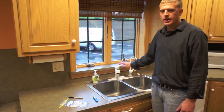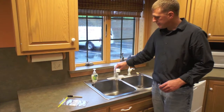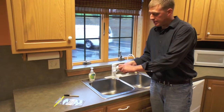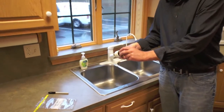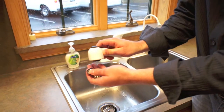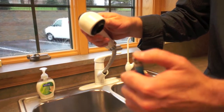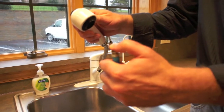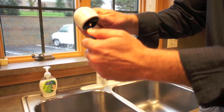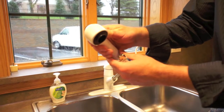You can shut off the water and the next step is to take your match or lighter. At the tip of the faucet, most faucets will have what they call an aerator and that should be removed from the faucet — there could be some other items inside. Then take your lighter or match and carefully flame the opening of the faucet for three to four seconds to properly sanitize the faucet opening.